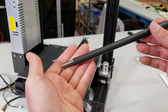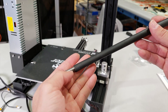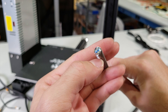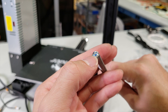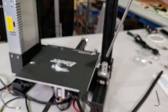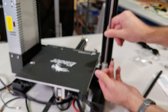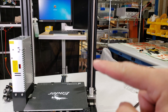Now we are going to connect our lead screw, which comes inside a rubber protector. Take it out and slide it in. One more thing before we connect the lead screw — the section marked with blue needs to come to the top. This section goes into the coupler like this. After you put it in safely, fasten it. Also make sure that your lead screw is aligned with your aluminum profile so you can visually confirm it is parallel.